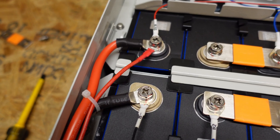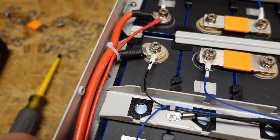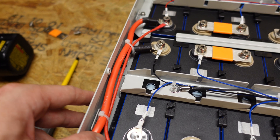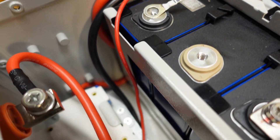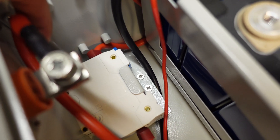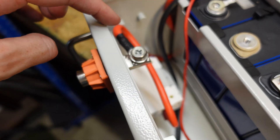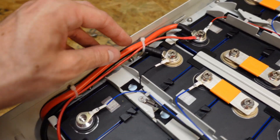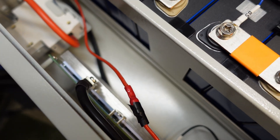Taking a look at the left-hand side, we have our main positive and our main negative conductor. They are comprised of seven gauge silicone insulated wire with a 200 degrees Celsius insulation rating. The positive conductor comes down and goes into the circuit breaker, then exits the circuit breaker and comes up to the positive terminal of the battery. Additionally, we have a smaller red wire — this positive wire coming off — going down to supply positive to the BMS for the BMS working voltage.